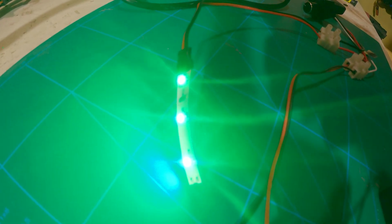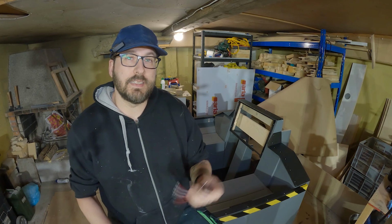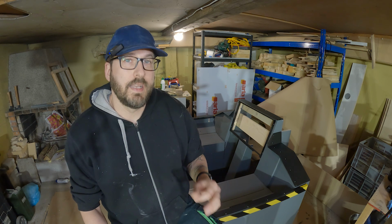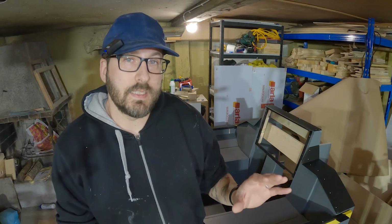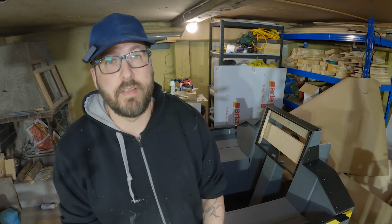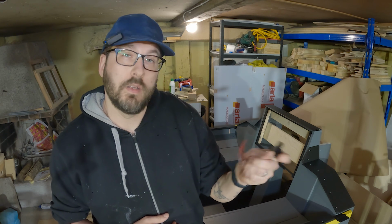This is actually worth noting because I diagnosed the problem in the wrong way and ended up buying these unnecessary expensive LED dimmers. The PSU that I'm using actually has a minimum load. And if I'm not providing enough load for it, it doesn't provide me consistent voltage or consistent output. I'm quite sure that my plans here will provide enough load for it, so I don't think I have any issues here. And in the end, I still ended up with quite good LED dimmers.